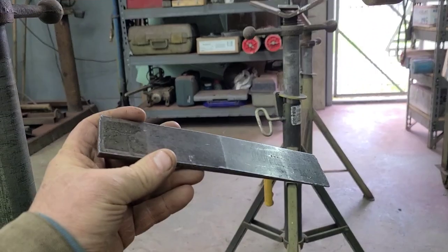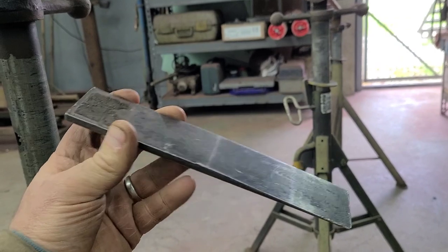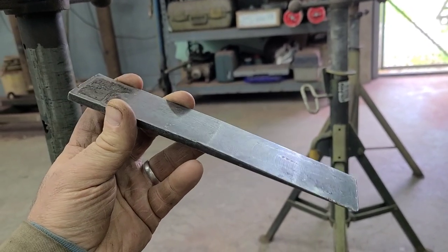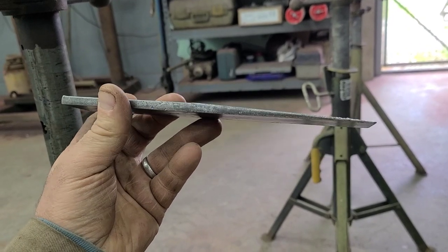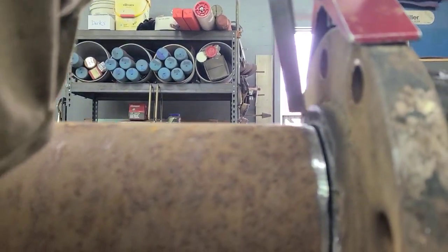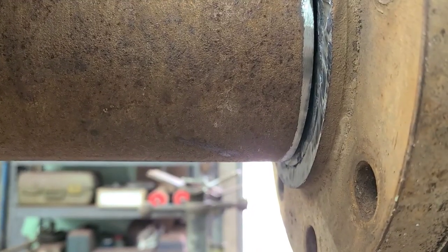Next thing I'm going to use is a wedge. I'm going to use a welder's wedge. This is one of the wedges like you buy from a welding supply. They're really nice. You can also make wedges, but you can see based on the shape of this why it's called a wedge. It's shaped like a wedge. And this spacing wedge, I'm going to slide it right in here, and I'm going to push just slightly till I get that eighth inch that I want. Just like that.